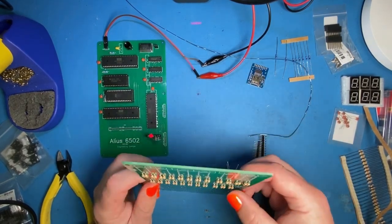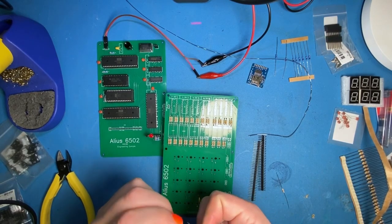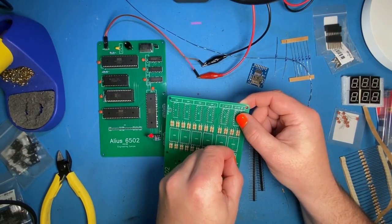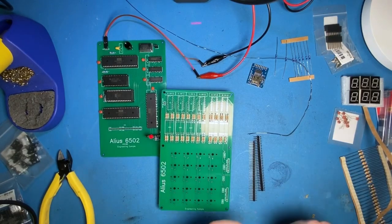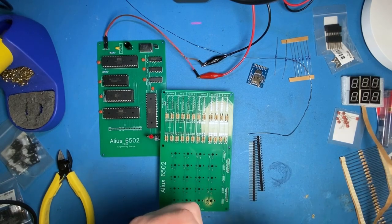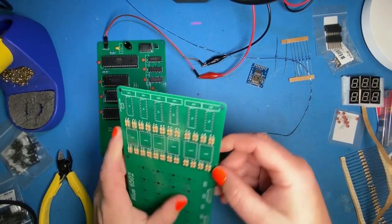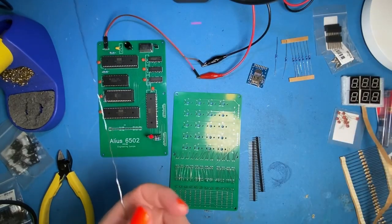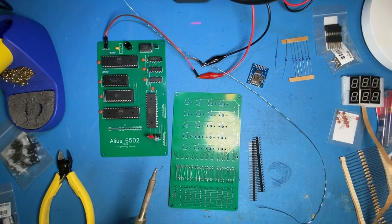There's something agrarian and pleasing about a CPU where you have to hand-roll your multiply instructions. The other routine I've put in the ROM is a random number generator — a linear feedback shift register. The problem is how do you know whether it's working correctly? It gives numbers that appear random but that doesn't mean it's right. It's never going to be cryptographically sound — an LFSR is a periodic random number generator. But it'll be good enough for Hunt the Wumpus. I've actually written a classic guessing game where the computer picks a random number and you guess higher or lower — that exists in the GitHub code collection.